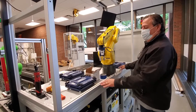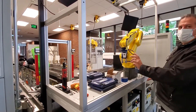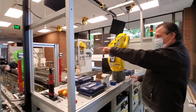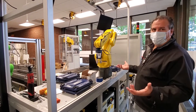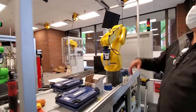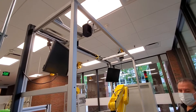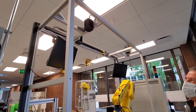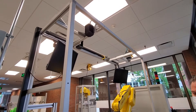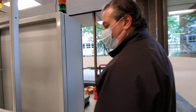These are Toledo scales — essentially the tare. We can know exactly the weight of each vial empty, because there is variation in vial weight and you need to track that so that the quality check weight scale readings are accurate all the way around. These are Odos time-of-flight cameras — they do volumetric checks. They're not really cameras; they're scanners that take a three-dimensional volumetric image. They're not included in the control system but are available for analytics and determining what happens to be in a certain place.